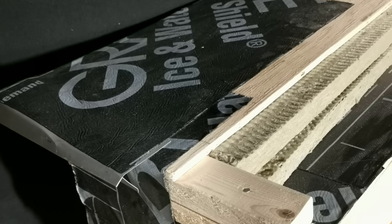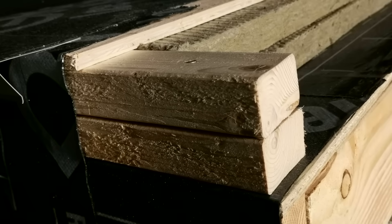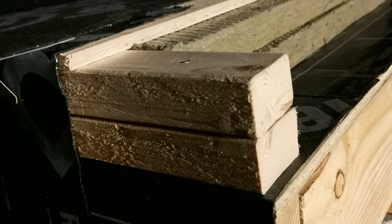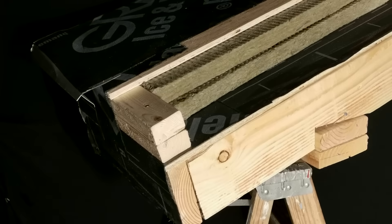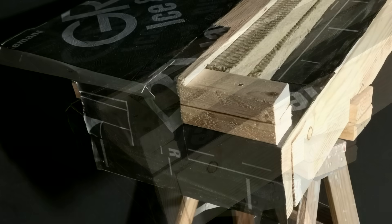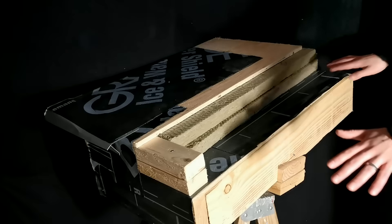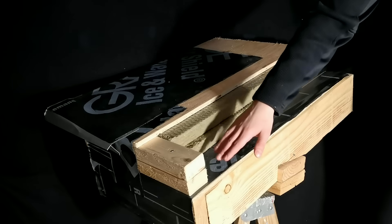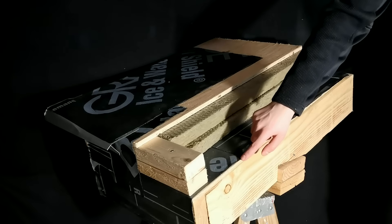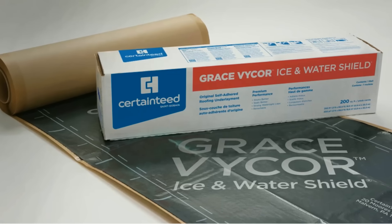We have a mock-up here of our first assembly. This is probably the most common or conventional way to integrate exterior insulation in a roof assembly with the least amount of structural complexity. Our rafters are cantilevered, forming the overhang — this could also be your trusses — but the point is that the overhang is part of the roof structure. Very typical construction. Then, installed over our sheathing, we have a self-adhered membrane which is serving as the air barrier in this assembly — in this case, Grace Ice and Water Shield.